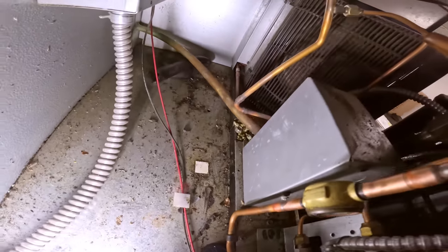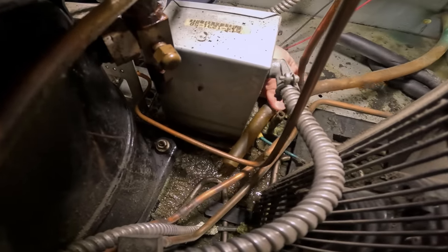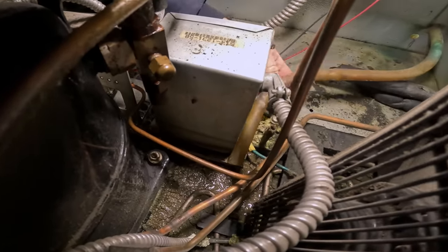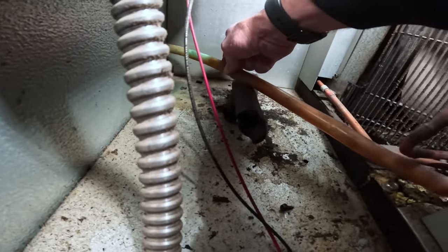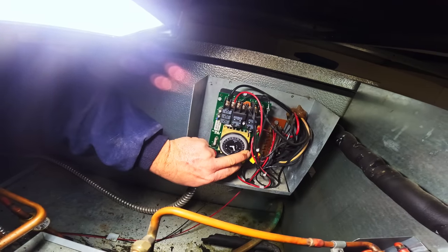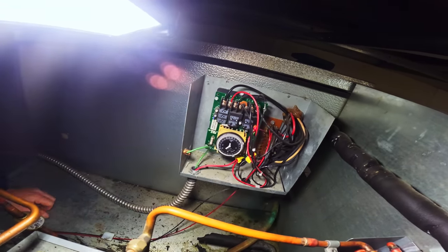Okay, full sight glass — not that that would make a difference for your drain. You can see it has been draining into the pan here. You can see somebody put a piece of insulation tape here to not allow it to sink down and trap itself. It just came out of a defrost cycle, that's why it's still wet. Let's see if we can clear a tile out and make a little room.